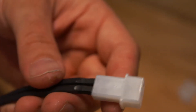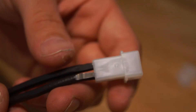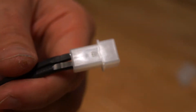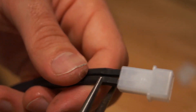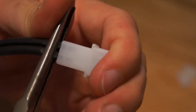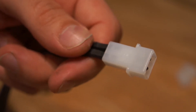Finally, if you have trouble putting these pins into the terminal, you may want to make sure that you've gotten enough of the insulation cut down. You can also use some needle-nose pliers to give yourself a little more leverage. Now I'll do this for the rest of the connectors.